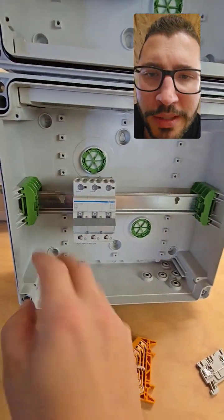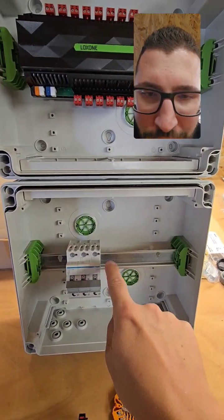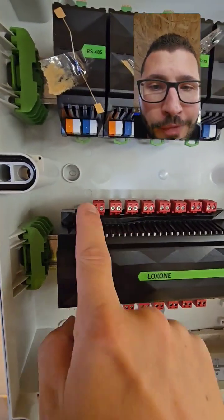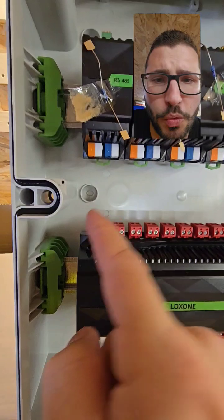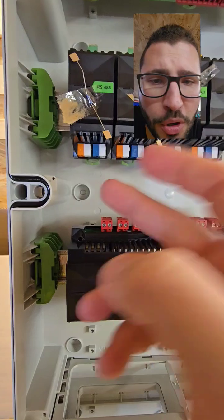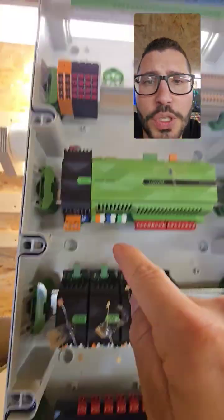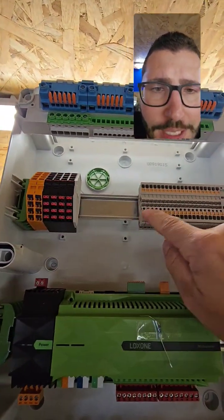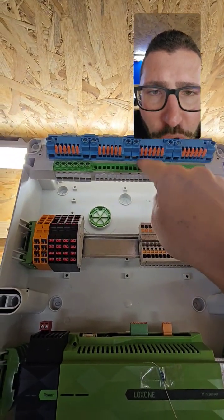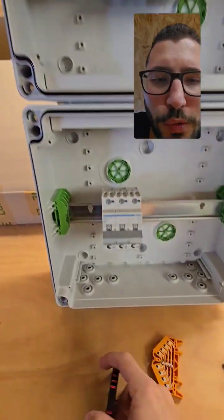I'm still waiting for some components — there will be the RCD on the high voltage side. For the filter pump there will be a breaker here, and I use the potential-free relay, so this switches 230 volt — can be 110 as well, can be 24 volt for the watering stuff. When the mini server decides, minimum 10 hours a day but preferred with free energy, it switches. Then this goes on top here on my terminal blocks — I will show you in a second. We just connect the pool pump coming here on the first one, and the neutral and protective earth up here.